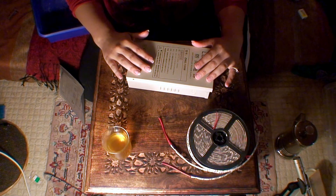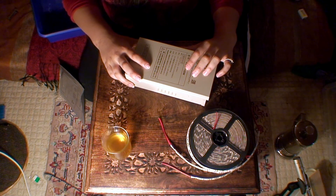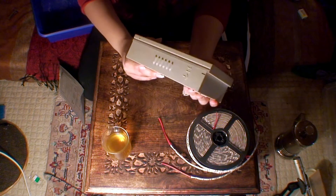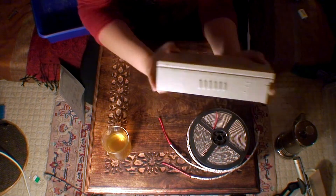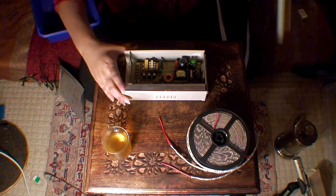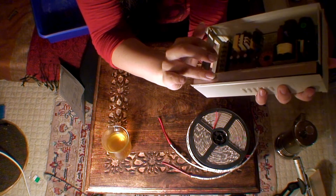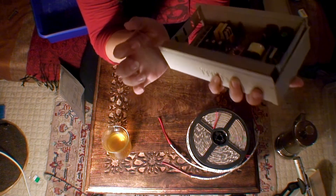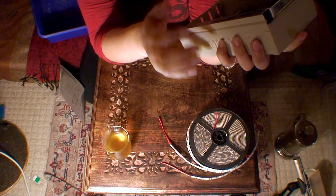Now this lighting rig is going to be very powerful. We're going to have a power supply that's 150 watts, which goes up to 12.5 amps. It depends on what wattage you want, but you have the LED power pack here. It puts out plus 12 volts, and I think this is a dual power supply so you may be able to get 25 volts from it — however, the power will be halved of course. All we need right now is 12 volts.